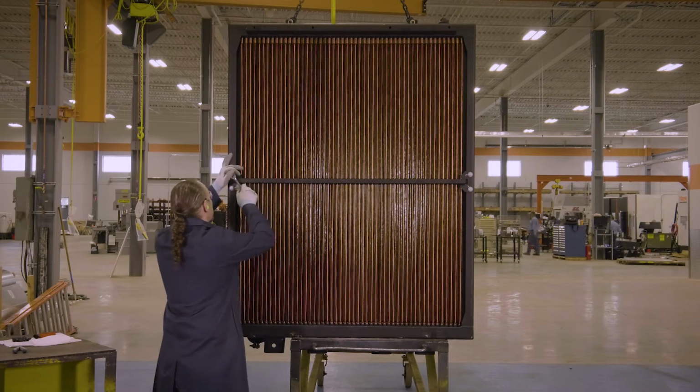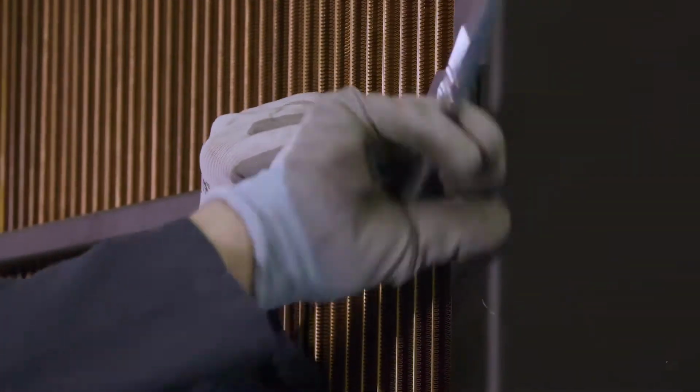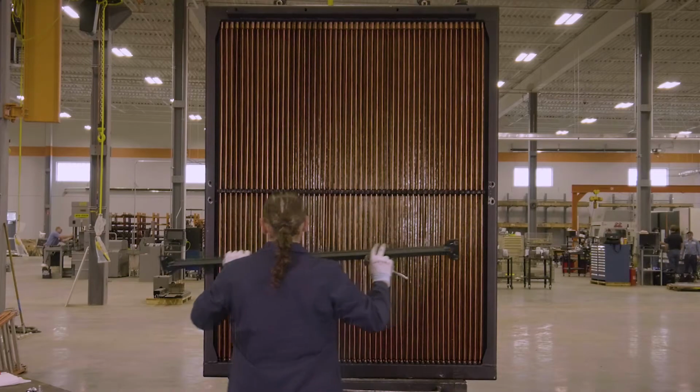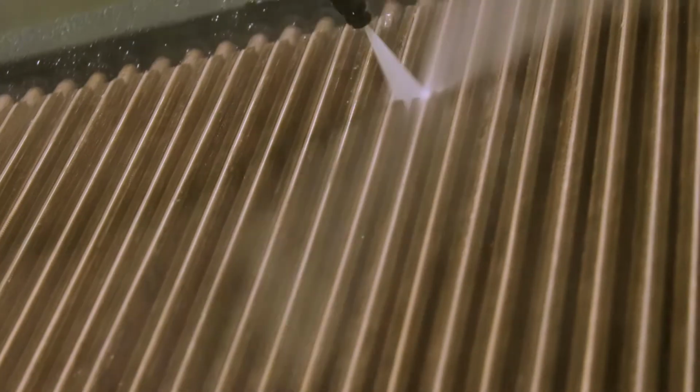Begin by removing the ITS bars, or individual tube support bars, if the radiator is equipped with them. Mark which side they are removed from, as they may be different. Then, if possible, heat the tubes and seals with hot water to ease removal. You may need to do this row by row and section by section, and repeat as may be needed.